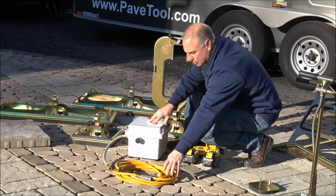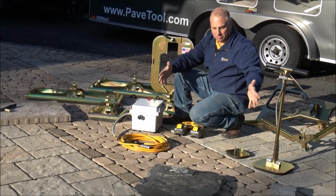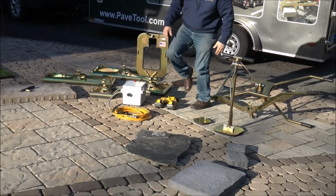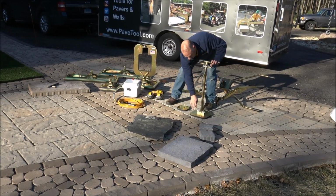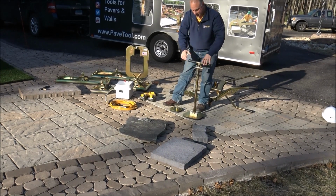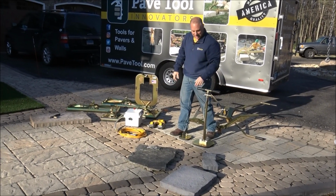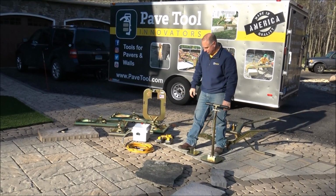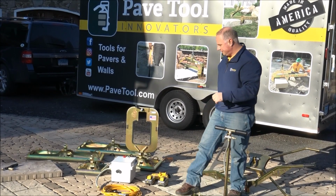We can hook it up with a hose, and that'll allow us to pick anything from smaller handheld slabs with our T-handle. So again, we have a little 6x6 pad, and we have a 10x10 pad, all gonna run off this toggle switch. Again, allowing me to pick up some irregular flagging, wet cast products, our 6x6 pavers, really fast, really efficient for doing that, standing up obviously.